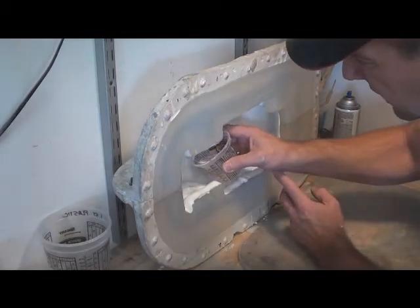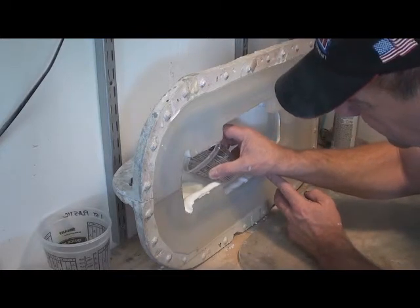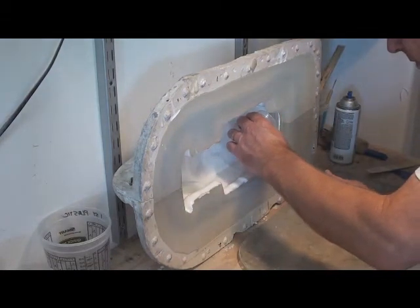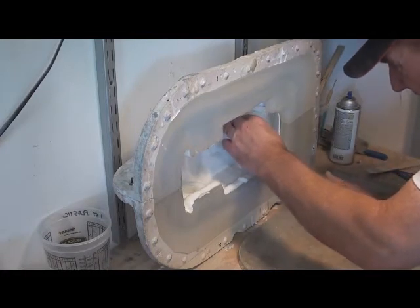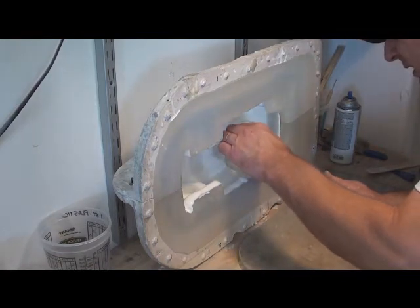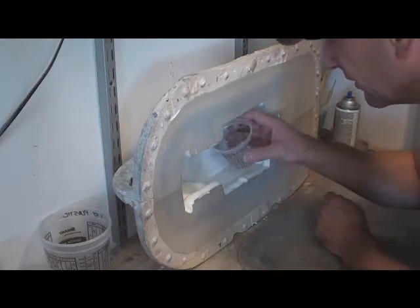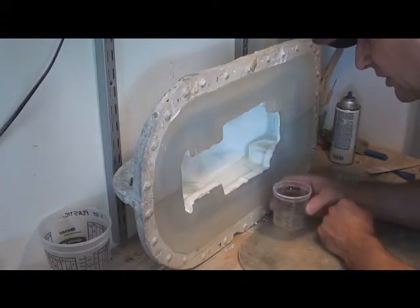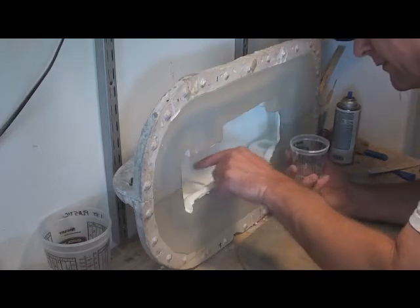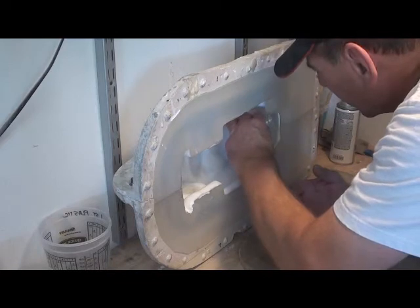I pour the material in to fill up those cavities, then let it drain over the top of those edges to thicken them up. This is a tedious part — covering up all those edges, then letting the material gel just a little. It'll start to thicken a bit and I'll give it another coat. Our goal here is to try and fill up to create a little bit more strength over the top of these spots where it's thin because it's a sharp corner.